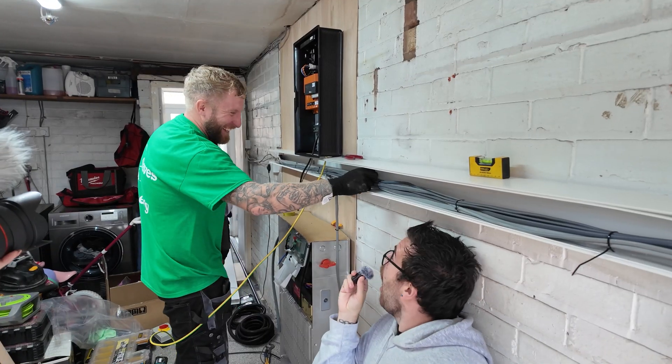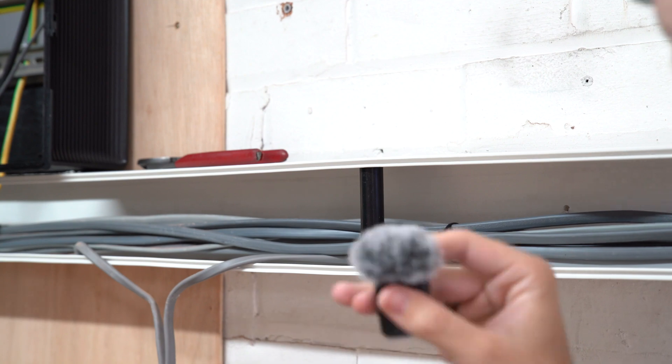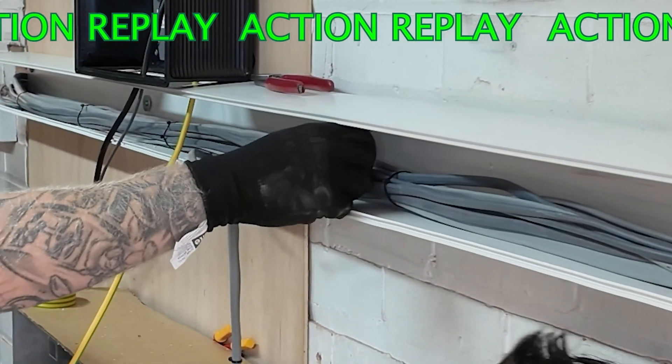It's not really a trick — it's just a way to get all the cables in. The trick: use a short off-cut of 20mm conduit tube at 100mm as a stop, so when you're wiring you just put it in to the trunking and it stops the cables pulling through. Did we see that? That's a trick — I think we might need to get the slow motion on that, because that was absolutely mental.